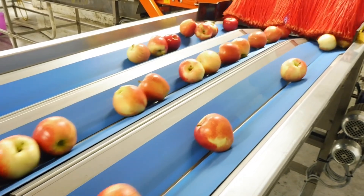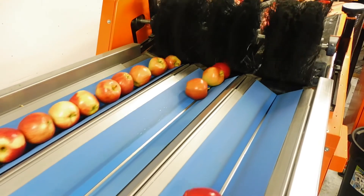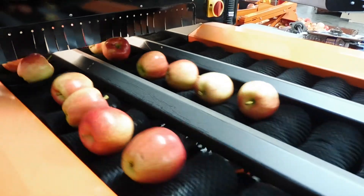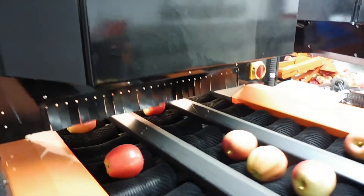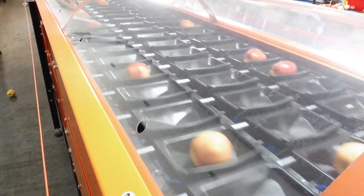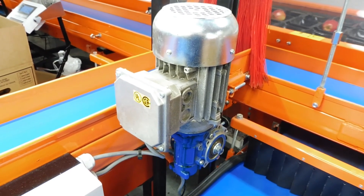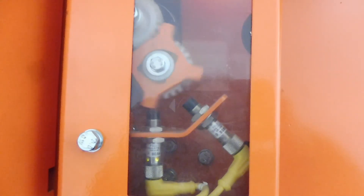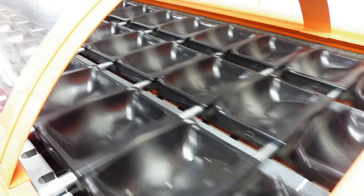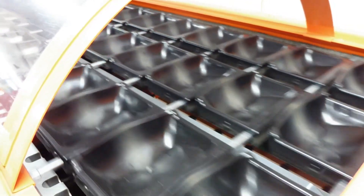The apples are sent into the camera — before entering they have to be separated and spinning so the camera can take about 30 scans of each apple to get the correct size. After going through the camera they're put into a cup, which is sent down the conveyor belt and exits onto certain conveyors for different apple sizes. The computer knows how far to send each apple using a Hall effect distance measurement system that tracks each cup's position, then dumps it. Empty cups are fed back to the beginning.